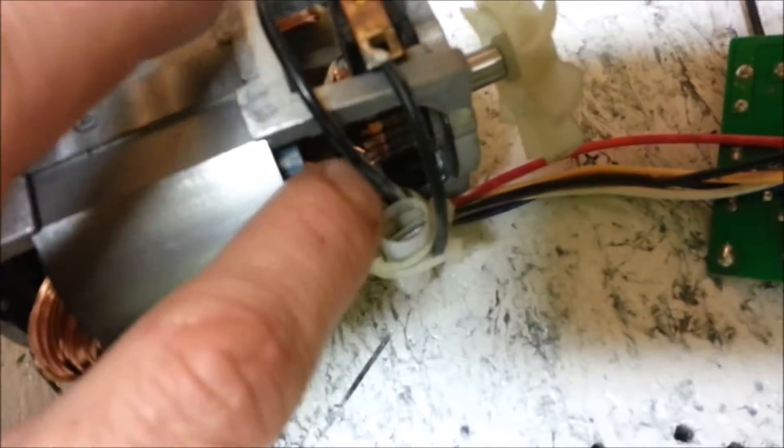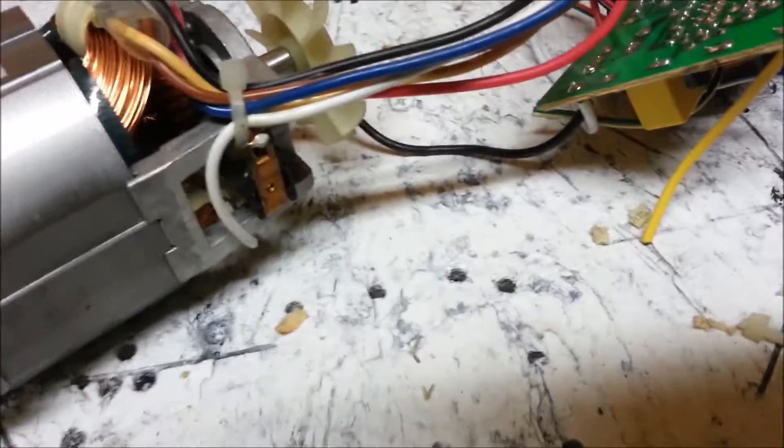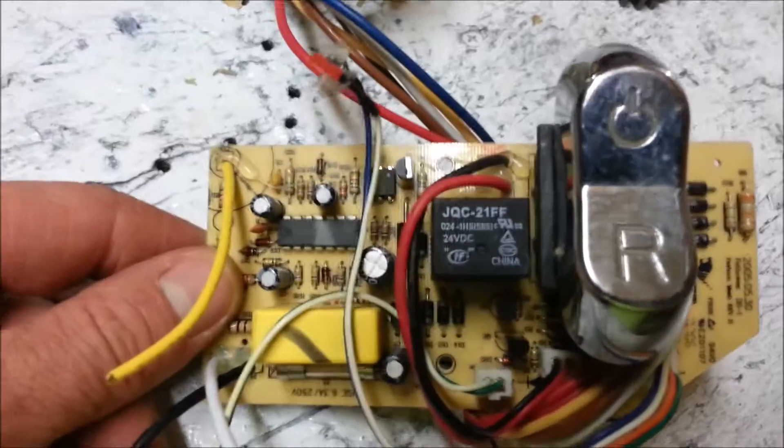I have the white connected to my stator coil, which is then jumpered, and on this side coming out of the other side of the stator coil is a blue wire. So I would assume you never connect the blue and the white wire together — it's always going to be an alternate of blue and black, black and white, or something. But my question is: why is all this circuitry on this board?